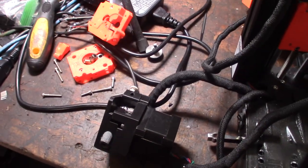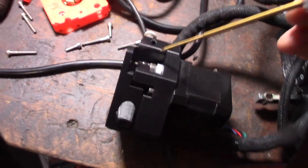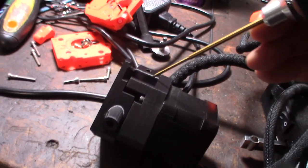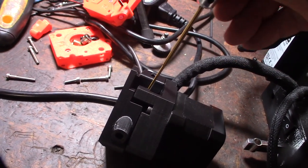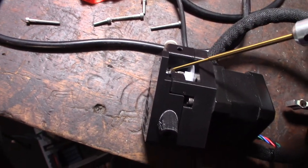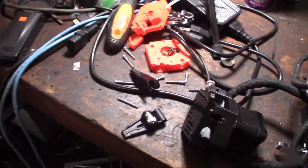One thing you might need to adjust — see that little set screw? The hob gear here is not lined up with the feed hole. I moved it over slightly, and now the hob gear teeth are lined up with the feeding hole.